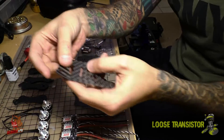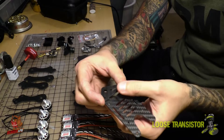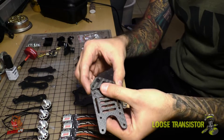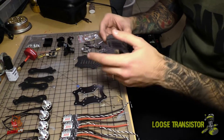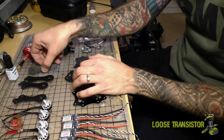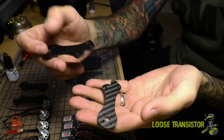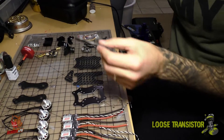I actually quite like this removable antenna feature. I've been flying it on the 5-inch for a little while now and it's quite handy to just pop this off and pop everything out without worrying about your antenna. It seems to be quite resilient — I've crashed it a few times on the 5-inch frame and haven't broken it yet, which is quite impressive. The cutest part of this frame is of course the little arms for the 3-inch build. They're all removable, quite well finished, and they look quite sturdy. I believe this is about 4 millimeters thick — let me pull out the calipers and confirm.